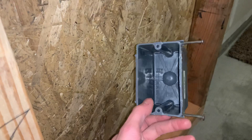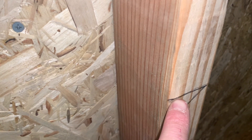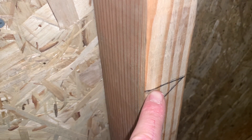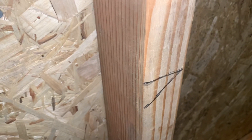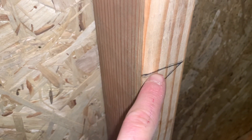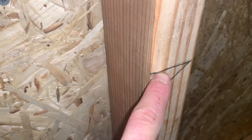You'll have your box right here, and basically this line means this is your measurement mark, the first one. I measured these both at 20 inches because mostly every plug is at 20 inches, unless it's a special arrangement like for a wheelchair room where plugs might need to be lower. So this first line straight across is your measurement mark, and that is at 20 inches.